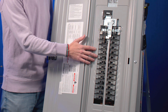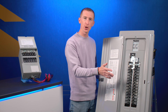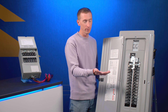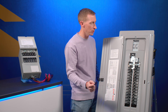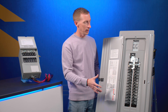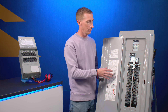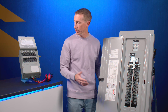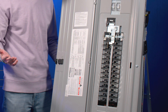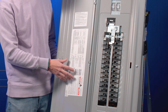There's also no limitation on the size of circuit breakers you can put in here. Any one-inch interchangeable UL listed circuit breakers can go in, ranging anywhere from 15 all the way up to 100 amps in some cases. That provides more flexibility, but the installation of a product like this is much more in-depth and can be quite costly compared to a transfer switch. The more circuits you want to run, the more complex the installation gets.